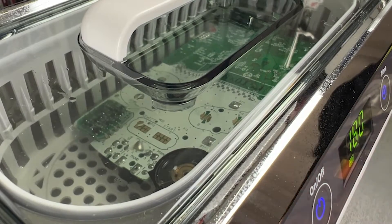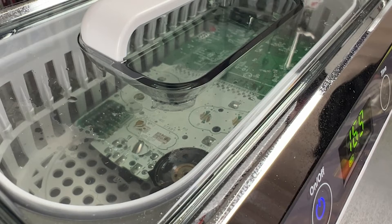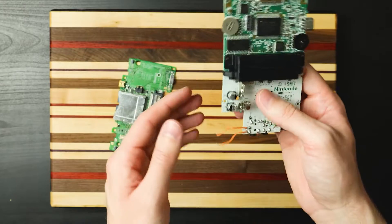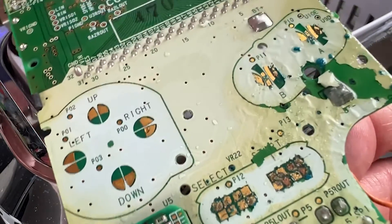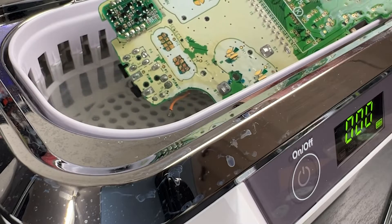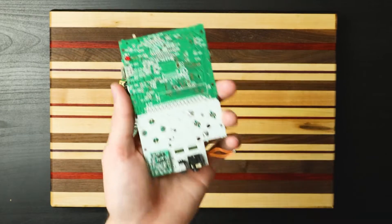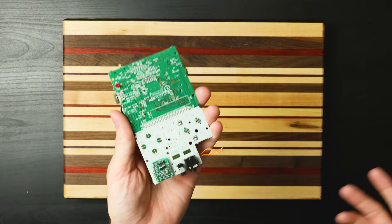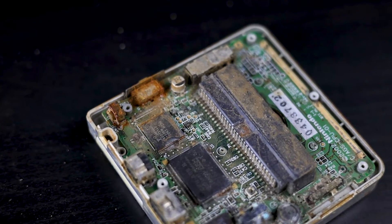By that point there's been so much flux across the board from reflowing everything — even if I'm cleaning with isopropyl alcohol, it's just sticky and gross. So that's when I throw it in the ultrasonic cleaner. If it still has a good speaker, I remove it — I leave the wires on because it's easier to re-solder to the speaker than to the holes. If the board is covered in corrosion, the ultrasonic cleaner doesn't really fix that — it might make the corrosion cleaner, but it's still going to be corroded. A little rust? Yeah, it actually will help. Not a ton of rust, but it can work.